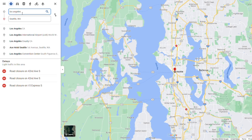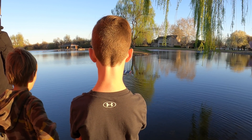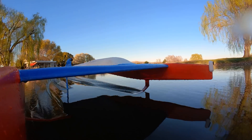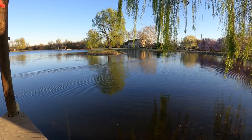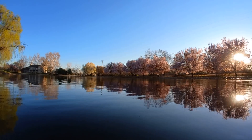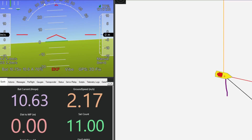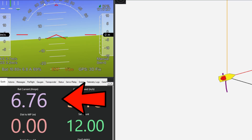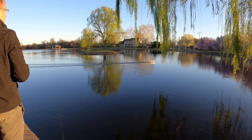A trip north was needed and I decided to take the hydrofoil with me to see if I could get some cool video along the way. Some very helpful family members found the top speed from the telemetry on the computer — 6.85 meters per second. Looking at the telemetry later, it became apparent that the minimum current at cruising speed was about 20% greater than the solar panels could deliver in ideal conditions. This was not the result I had hoped for.